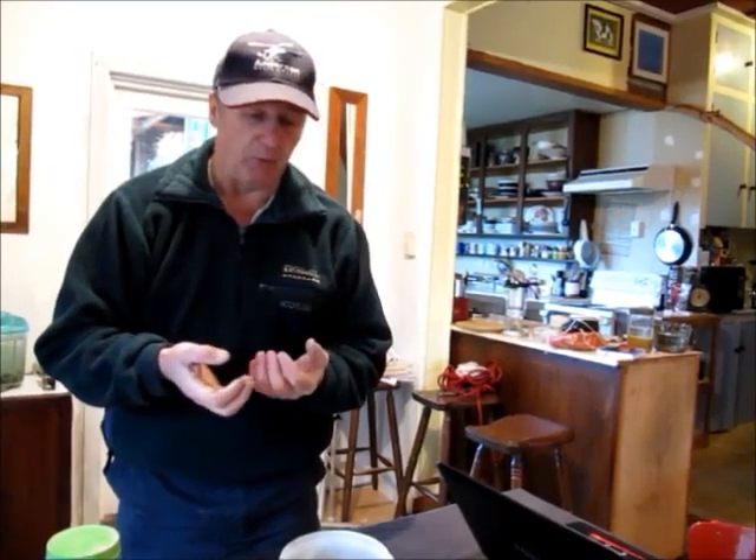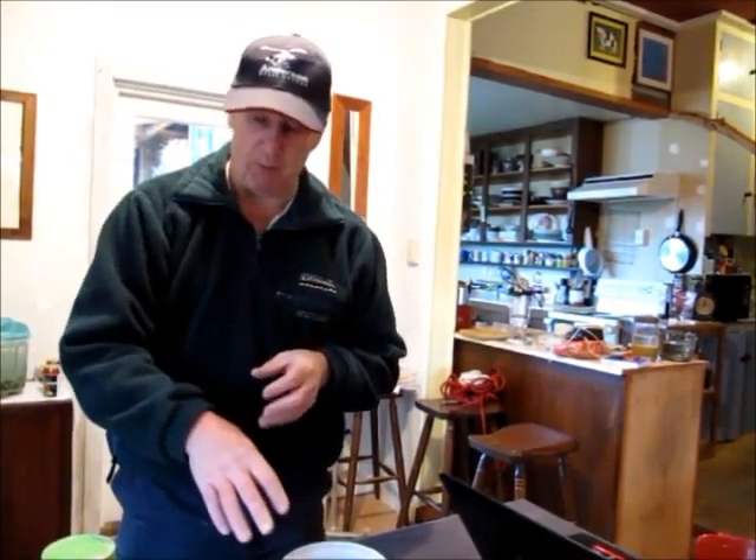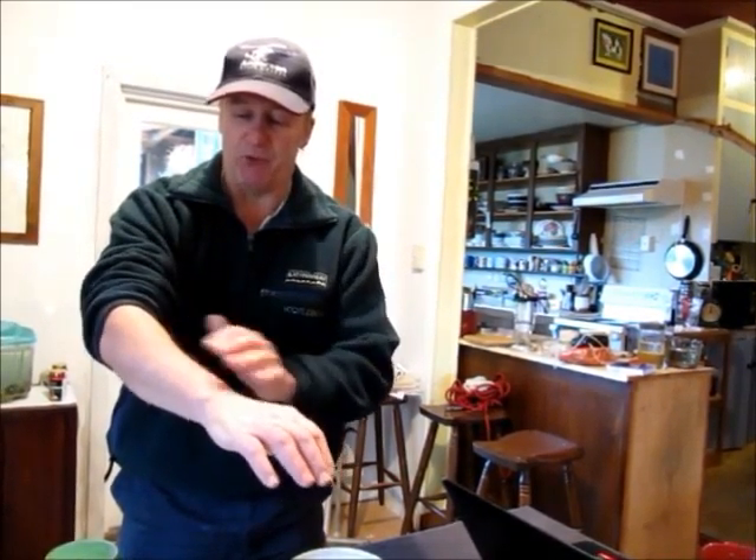The wash test is really once you start to add water to the soil — the clay particles tend to be the sticky bits, and as you'll see when we start to do the other tests, it will stick to your hands. You can rub it on your arms and let it dry, and see how difficult it is to peel it. All these tests are indicative tests — you can't jump to too many conclusions right at the start because you'll get caught out very quickly.